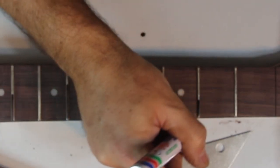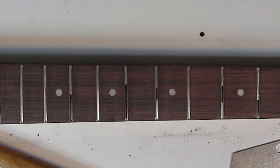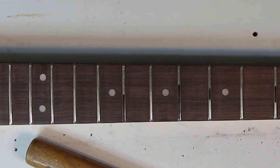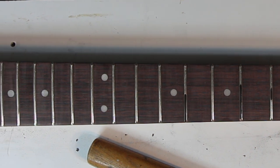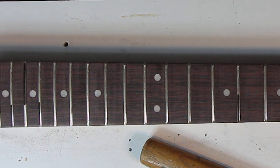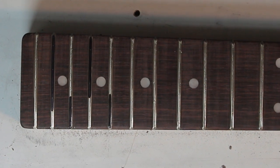When you're done rocking, you'll have all the high points on the frets marked — this can be whole frets or partial. This is also a testament to the quality of your fretting; good fretting should give you very little, if any, leveling at all. Looking at my marked fretboard, it's evident that I've done a fairly decent job overall, thank you. But the first few frets where I used the toy hammer are completely off — yes, I blame the hammer.